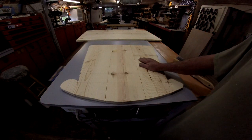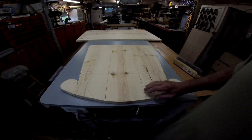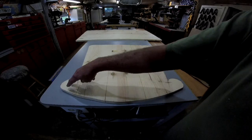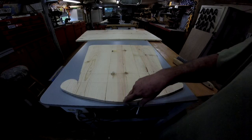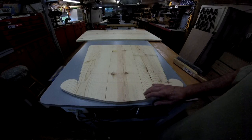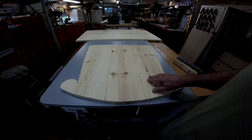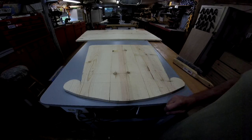Now this is the footboard. And before I transfer it to the other one to make it the same, I'll get the belt sander out, smooth everything, sand all these down to the line like it's supposed to be. And I'll probably go ahead and install this piece that goes here for extra strength, a little extra support. I have some more of the same kind of material in a 1x4, which will work just fine. And that will also cover up this little gap here. Now keep in mind, this is going to be painted, so little imperfections will never be seen. If it was going to be stained, it'd be a whole different process. But there we go. That'll do it for right now.